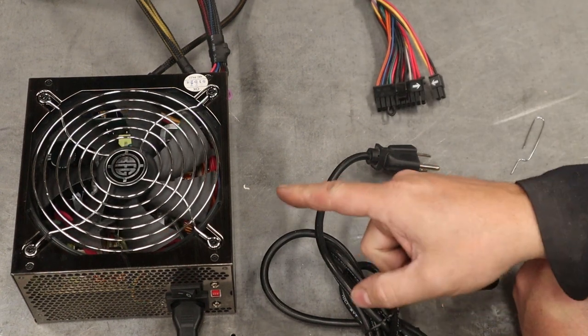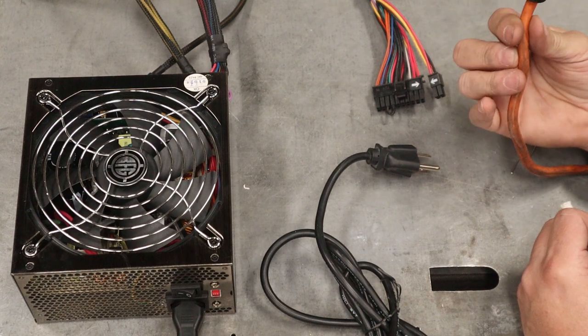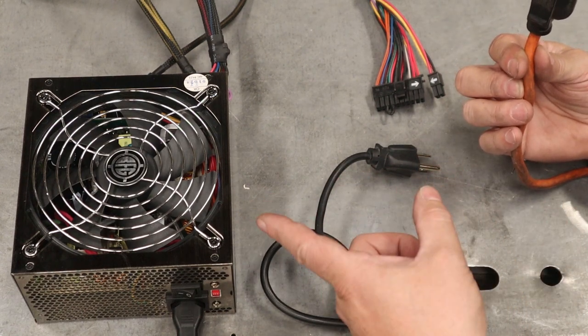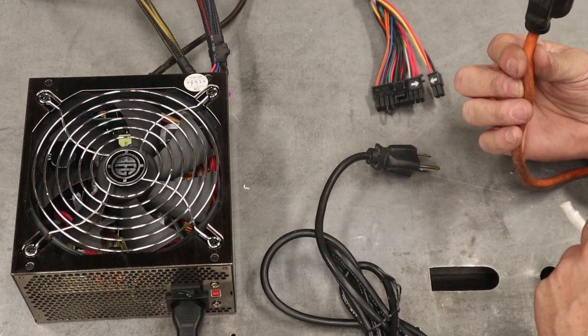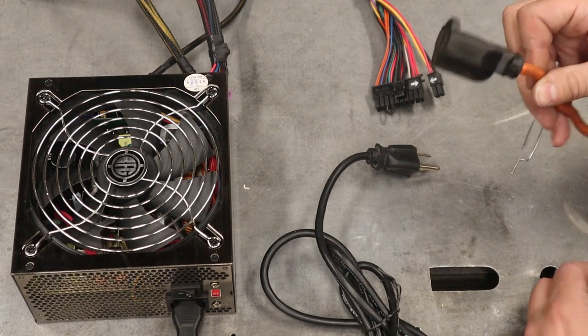And it'll turn on. Now that's actually pretty weird that that turned on because I didn't plug it in. So right there, that must be telling you that there is some kind of condenser or a capacitor in there that had power. This is why you don't work on TVs and stuff if you don't know what you're doing, because there was enough electricity in there still to hurt somebody.